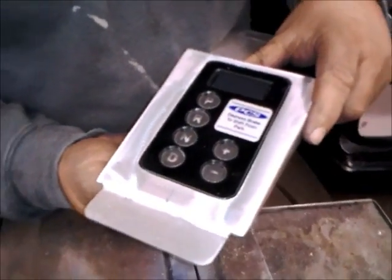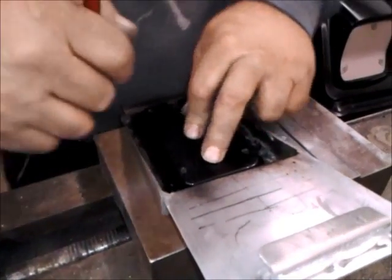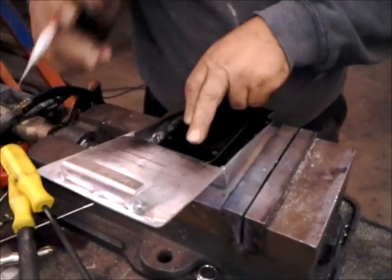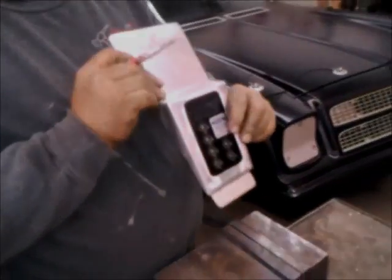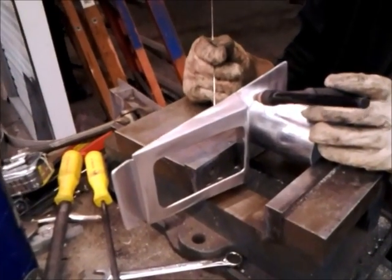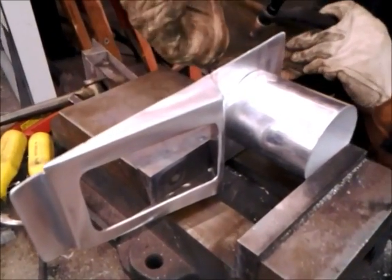What I'm doing now is scribing it back so I get these screw holes, and then we'll drill from the back and countersink it. Scott's getting ready to do our favorite part — he's putting a cup holder on there. We took a three-inch piece of aluminum pipe, cut off about three and a half to four inches of it, and we're going to weld it on there.